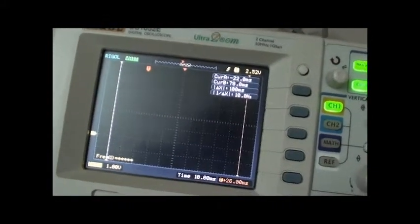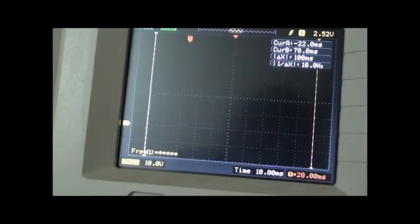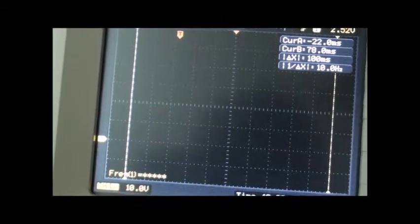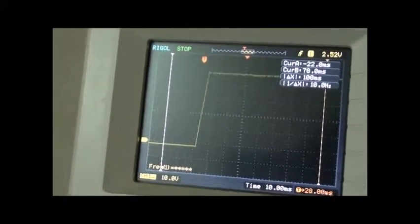Now checking at about 5 volts — it does go beyond 5 volts on startup. I've now set the power supply to about 24 volts. The jump in voltage when switching on is almost nothing, and because the oscilloscope scale is 10 volts per division, even a jump of one to two volts won't be seen clearly. Repeating the test with 48 volts: the jump is hardly anything, and again at this scale a few volts wouldn't be visible.